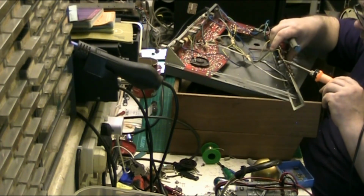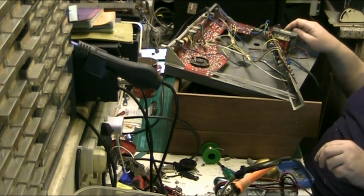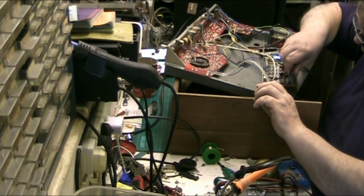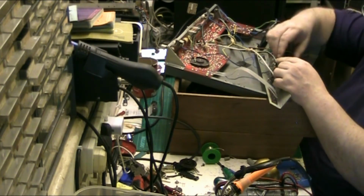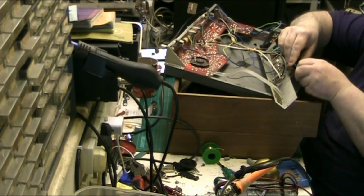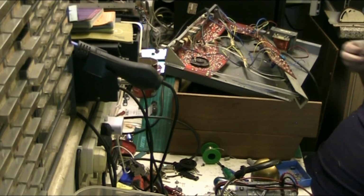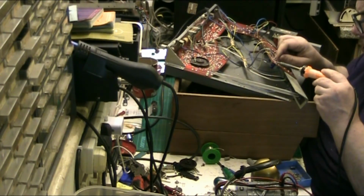I mean, the first thing I'll do with this, before I even put speakers into it, is I will check for the 24 volts. That should be present. Yeah. I'll be checking for the 24 volts that I know should be there, and it should be bang on. I'm expecting it to be bang on 24 volts. It might need adjustment now because I actually set it before I did this, but I'm not expecting it to be too far out.